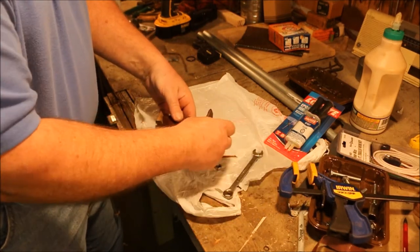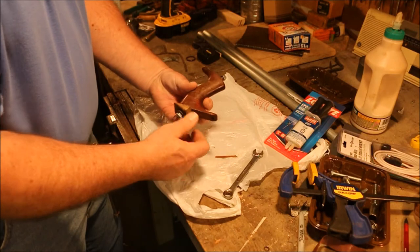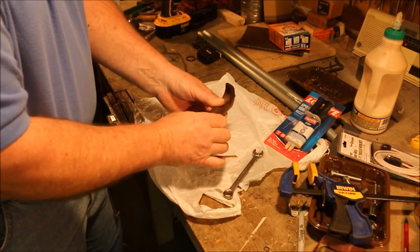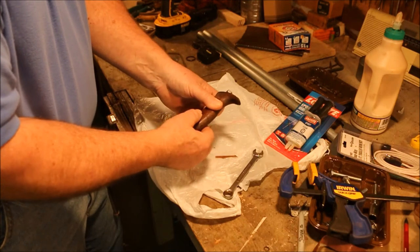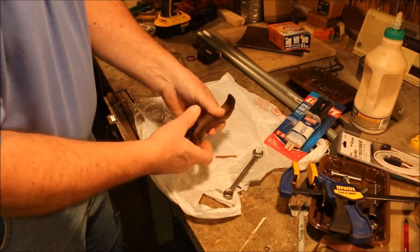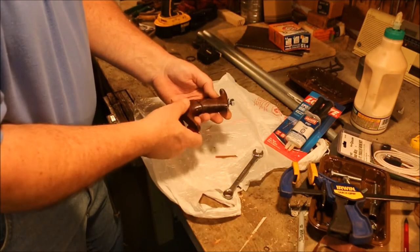And I just put a washer and the nut on the top and tighten the two nuts, pull this together. Sometimes I have to put a clamp on the sides to make sure everything lines up because the totes tend to get twisted when they break. I think the wood relaxes and the spring goes out of it. You can see that this side is a little bit bigger gap than the other side. This side is nice and tight. This one's got a little air showing in there. So by putting the clamp on it, I pull that together.